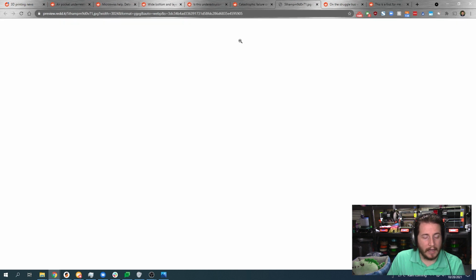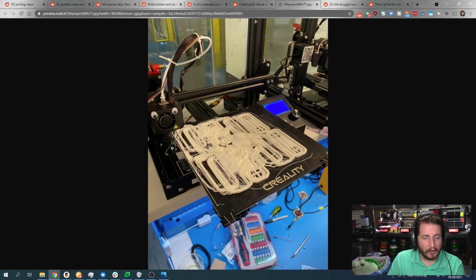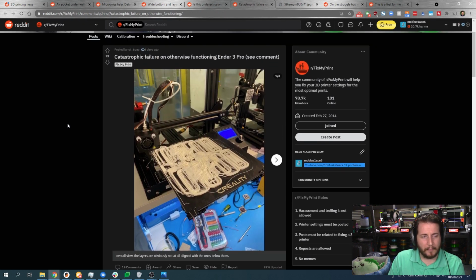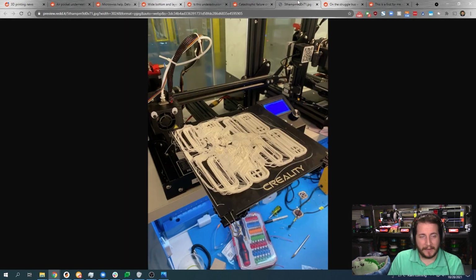Okay, well, ladies and gentlemen of the jury, I would have never come to that conclusion, because having random M4x10 screws on your Z-axis does not sound like something that I would have. But yeah, that's absolutely going to be what happened here. The Z-axis got jammed, it wasn't able to move, and the printer just started skipping steps, because the printer doesn't know any better. This is why I actually really like the Mark III's, because it does have crash detection.